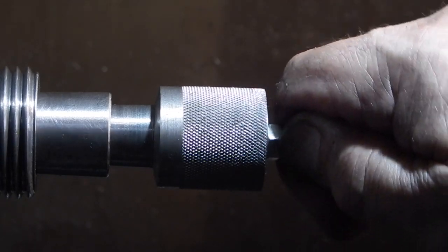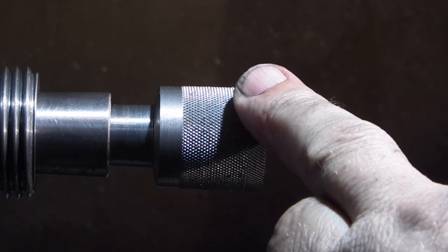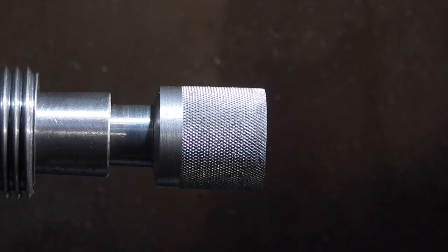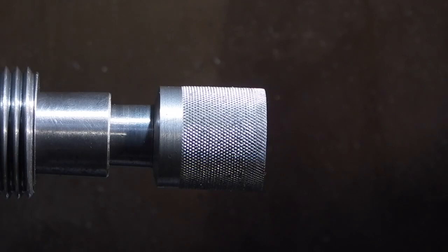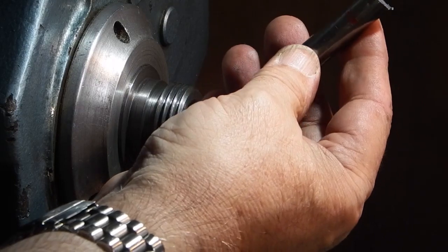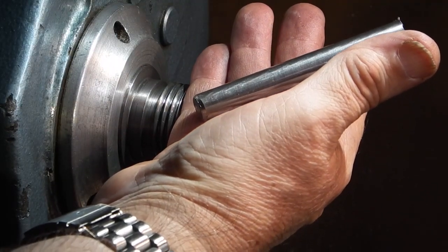To remove the bearings — so this hole is now the right size — I've put a knurl on the outside and taken the sharp corner off, and the body's finished. For the centres I've got a piece of half inch mild steel which will make two, it's a hundred millimeters long.